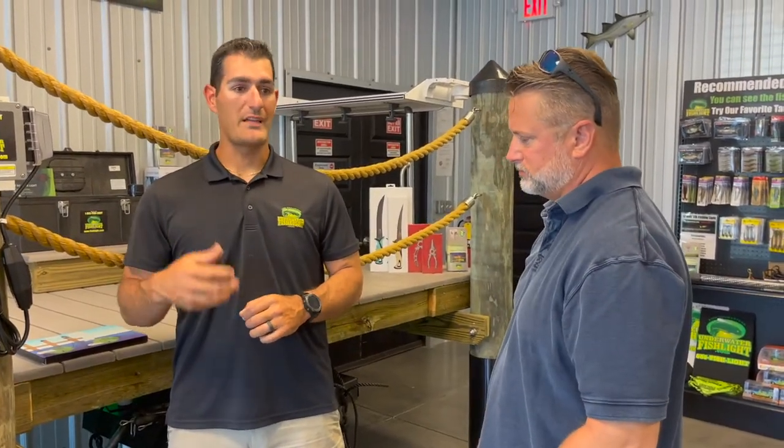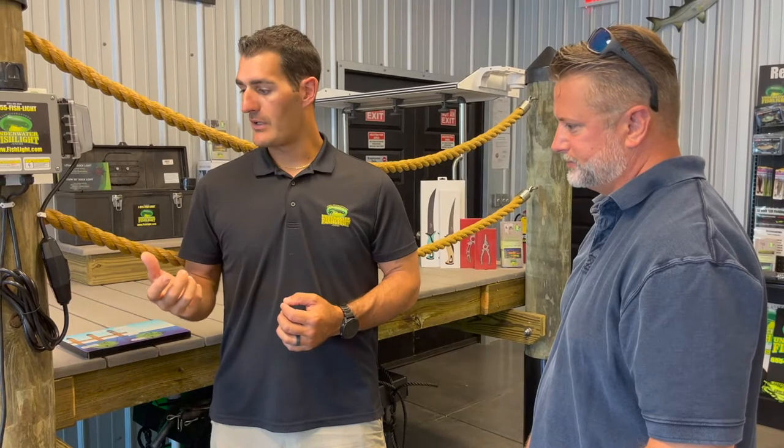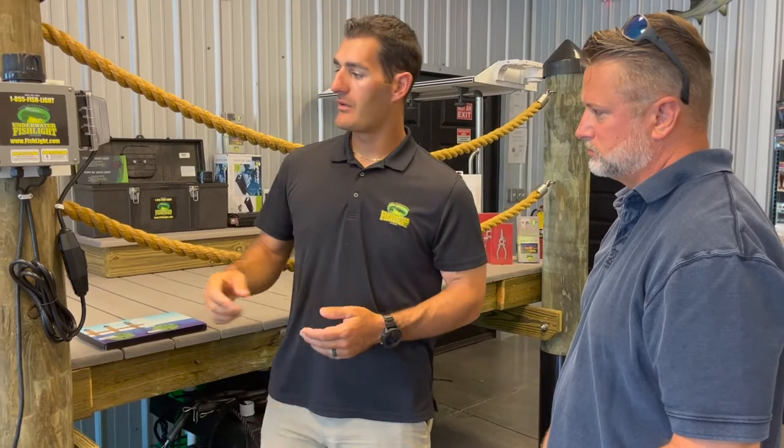There's one transformer, which goes out to a 50-foot cable of all underwater-rated wire, leading to a five-pound dive weight. That five-pound weight secures the light bulb down to the bottom and keeps it in place, because the light bulb is actually buoyant — like a helium balloon, it wants to float upward, and the weight holds it down. With about four feet of water at high tide behind my house, I'll want to keep that light bulb tight to the bottom. The best way to secure it is with zip ties — and when underwater, the water preserves the zip ties since the sun isn't beating down on them.